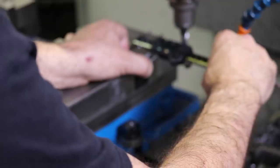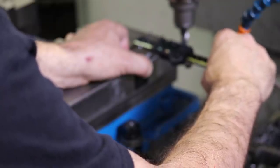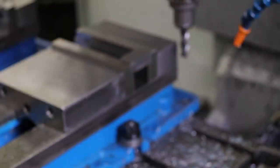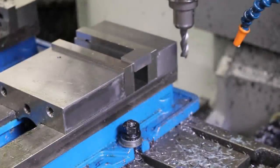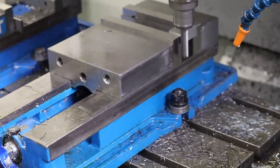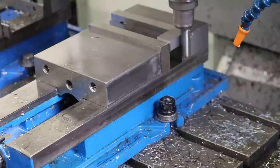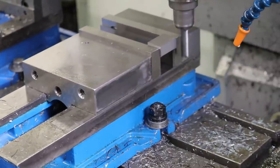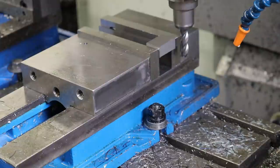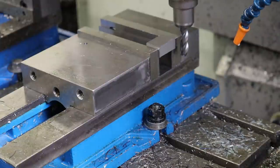Okay, usually your lowest number is the accurate number because that means you're most squared up. So we'll take 2/1000ths off this guy and then we will be ready to cut the second insert. I like to do it a couple of times just to maximize squareness. I'm also using the top of an end mill, which has cleaner, less used flutes as opposed to the bottom of the end mill, which usually is what wears out first. So these end mills are nice to keep when you're doing facing like this.